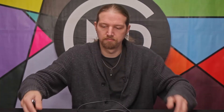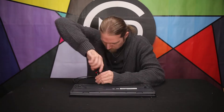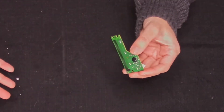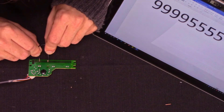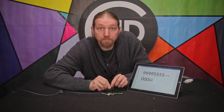Your basic $10 cheap keyboard just has a tiny little circuit board up in the corner with a bunch of pins on it. Let me crack this open and I'll show you. So this little thing is essentially all your keyboard really is. By connecting these pins in different combinations, you can create all the separate key presses that you need. So for example, if I connect this pin to this pin, I get 9, I get 5, dash, zero, and so on.